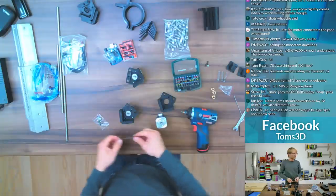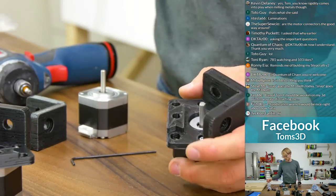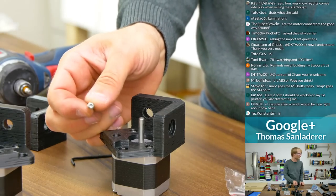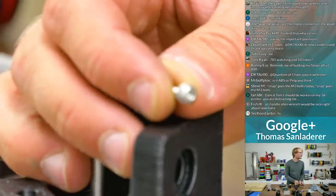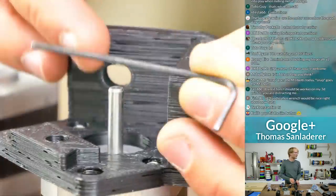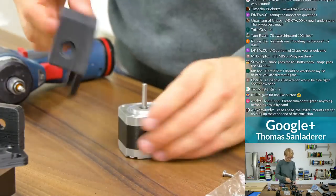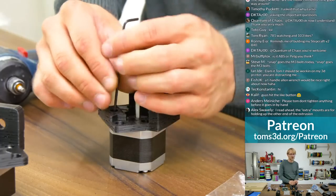Okay, T-handle Allen wrench, yeah, I don't have them in 2mm. I guess I could just grab a set of regular 2.5mm hex head screws, but these little mushroom head types have that 2mm size that I don't have any other tool for than these crappy cheapo L wrenches. So that's what I have to use, unfortunately. Not sure why they didn't just go with standard hex or even Torx screws.